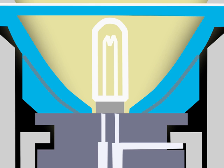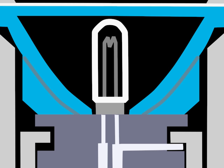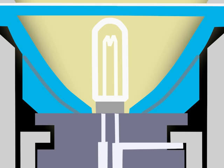When the light bulb goes on, the reflector expands and presses the switch cylinder down until contact is broken. Conversely, when the light bulb goes off, the reflector contracts and reduces pressure on the switch cylinder until contact is made. However, there is something missing in this picture. When the lamp switches on, why does it stay on for such a long time? Conversely, why does the lamp stay off for such a long time, sometimes even for many minutes?